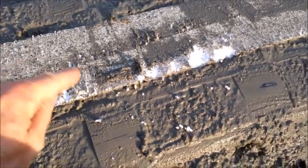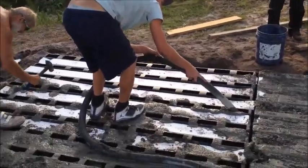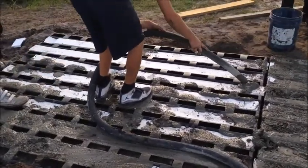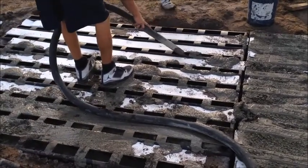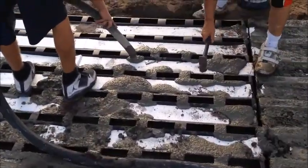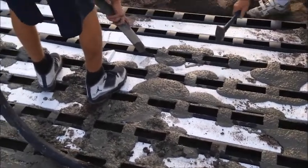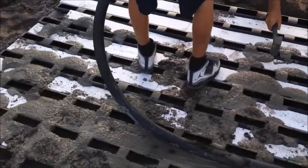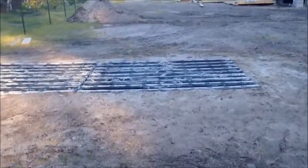He'll take his trowel and the leftover concrete and fill them up. Now we're working on the second one — he's filling it halfway then coming back to fill it up the rest of the way. It runs pretty good. If you don't have a pump, you just take your shovel, put a big pile there, and let it go into the holes.